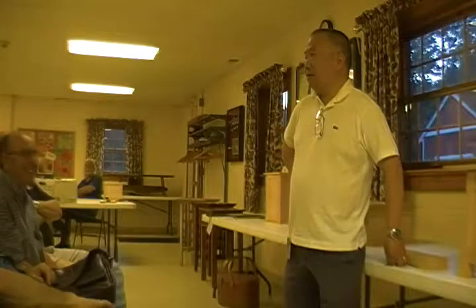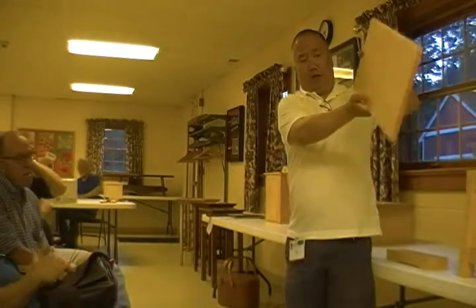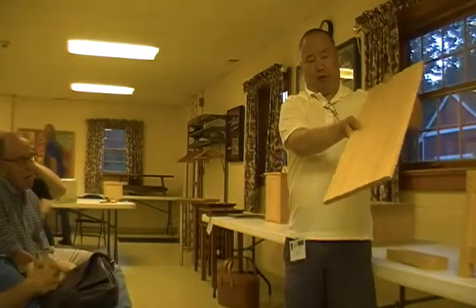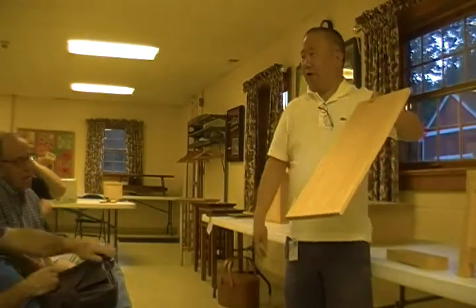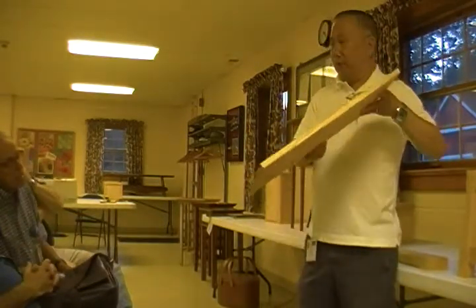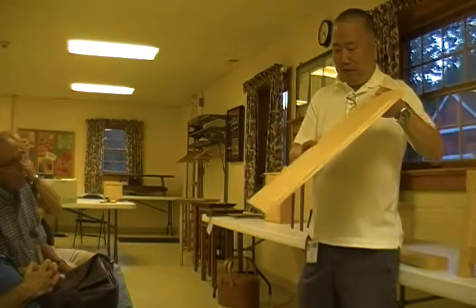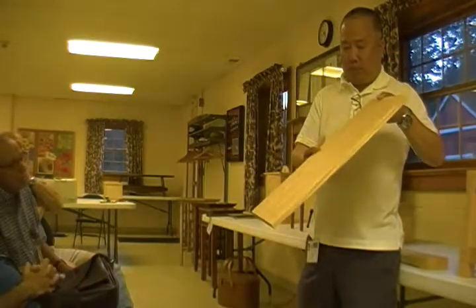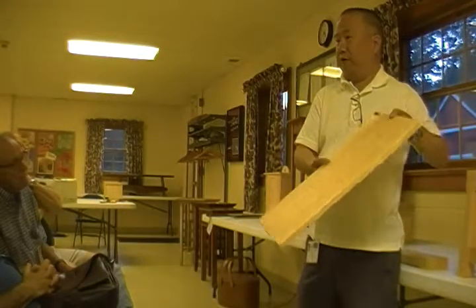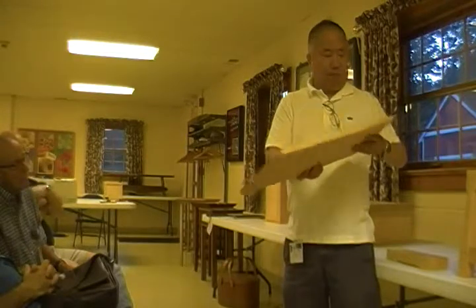That's true. What's that made of? It's red oak. That's the other thing I should probably point out. I don't know if you can see this, but if you want to come up and look at it, you can see there's amazing ray fleck. And that's because I started by splitting it. I never liked red oak up until when I split this thing. And this figure is so good, I actually can't remember a piece of white oak that I've ever seen with this much ray fleck in it. So, yeah.